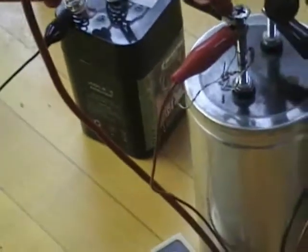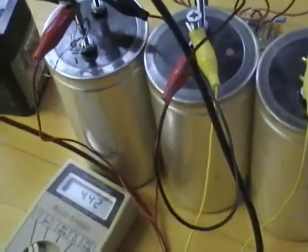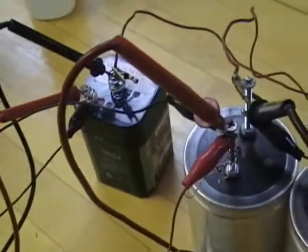From the collector, the negative on the battery I'm charging goes to the collector, and then the emitter goes to the negative on the cap bank. What I did was I charged that battery up and it went for 57 minutes from 6.37 volts, discharging that little light bulb right there. After charging it — pushing positive potential, hitting it on the plus side — the battery settled down to 6.17 volts, and it powered that little light bulb for 170 minutes compared to 57 minutes, so that's more than three times as long for the same load, starting at a lower voltage.